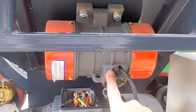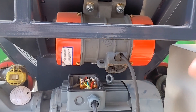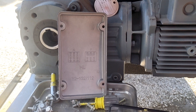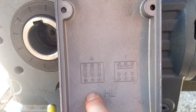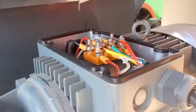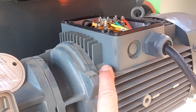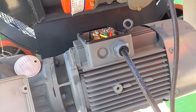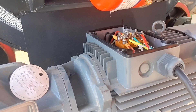We're just going to shoot some low voltage 3-phase into this with a VFD — they kind of have their own protection — and see if we can run it. Even if we can run it at 50%, it'll probably be fine. I believe this means it can be a Y or a delta connection. I'm not a certified electrician, but I certainly know enough to be dangerous. I'm going to try and test run this. This motor may only be 460 volt, however you can run them on a lower voltage — they just start slower and don't have the pull-through. Obviously it's not recommended to run them on that speed forever, but we want to do proof of concept.